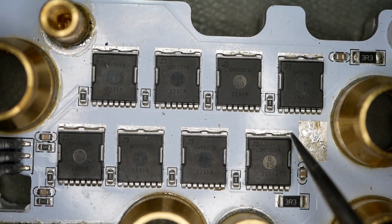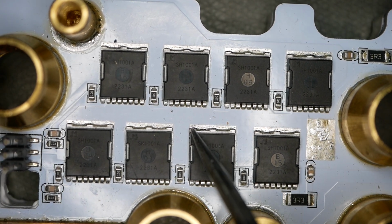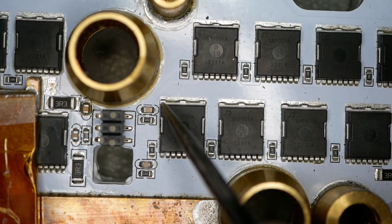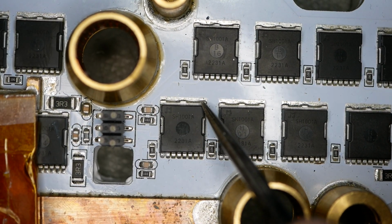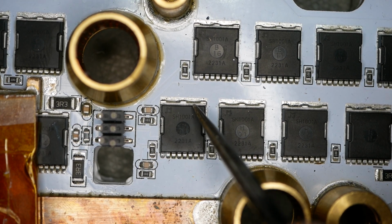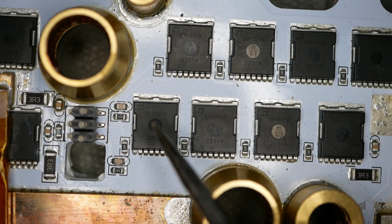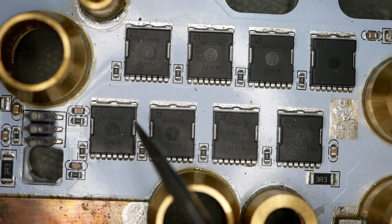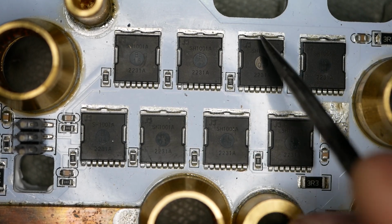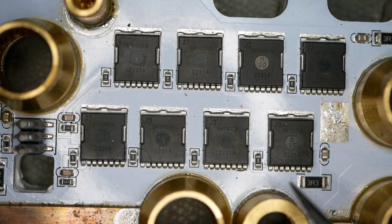These ones here with that very distinctive line like that, that one was replaced. That one was replaced for sure. Yeah, those ones for sure. This one probably was. You have a much thinner line, because this one here was almost put into place exactly where it needed to be and just barely had to shift to get down to exactly where they wanted it. So their reflow guy did a pretty good job in getting the MOSFETs all lined up. Some of them he had to tap down, like these ones, and that's why you get that little line, or that one right there, or that one.